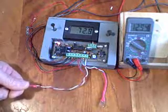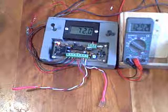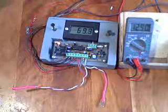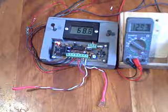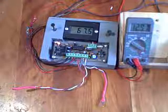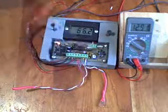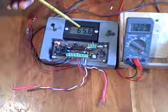So I'm going to release the probe now, and we'll let the temperature cool down, and we'll see how long it takes to turn the pump off. Now, we don't want the pump to go off right away, even though the temperature is going down. If that happened, the pump would be going on and off all the time and it would wear out the pump. Every time this pump starts, it's a bit of a shock. So now the temperature in the collector is 67 degrees. Remember, the temperature in the tank was 64. So as this gets close to that temperature, it should eventually turn the pump off.